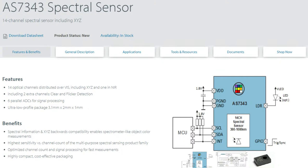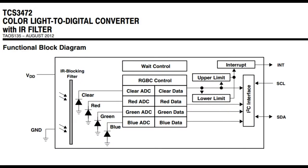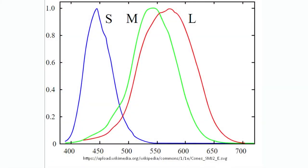We'll show all the different spectral colors. This is a great sensor that is really nifty because normally when you have color sensors, it's something like the TCS34725, a well-known and well-loved color sensor. This sensor has RGB and clear. It's a really old breakout we've had, and you can see in the middle there's four diodes — the clear diode, red, green, blue — and then they go into an ADC. There's some filtering done, and then you can read the data over I2C.